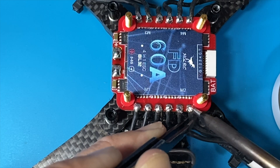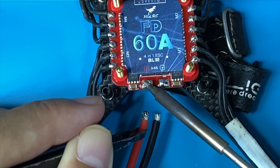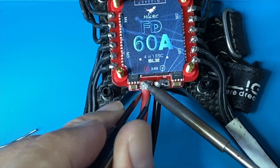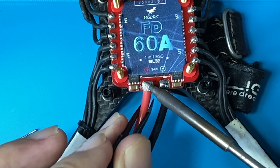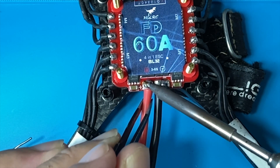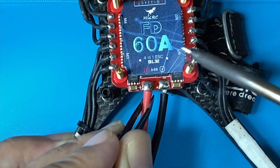Don't forget to use flux so that your solder will be nice, clean, and shiny. Soldering up the power connectors takes a really long time to melt — that's because of the heat dissipating properties of the ESC. It takes a while to get the positive and negative wires to fit just right; it took me a couple of attempts. Adding more solder shows that the ESC itself can actually take quite a bit of heat.